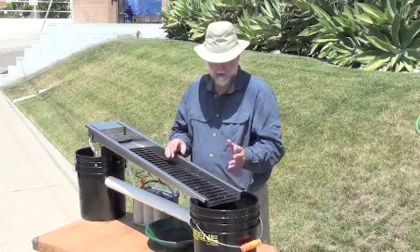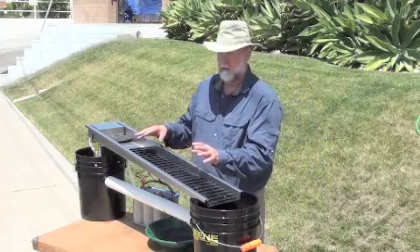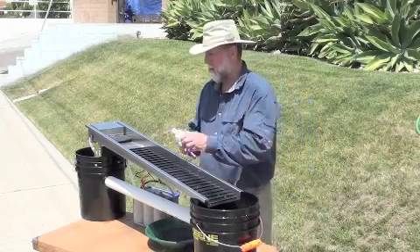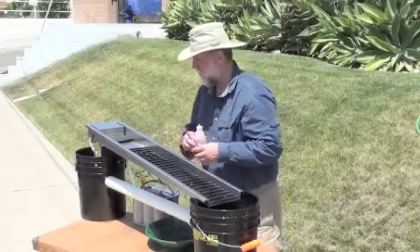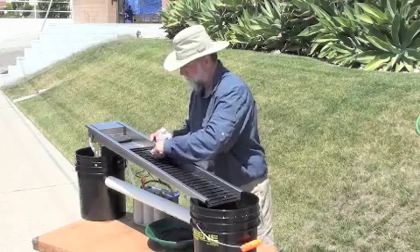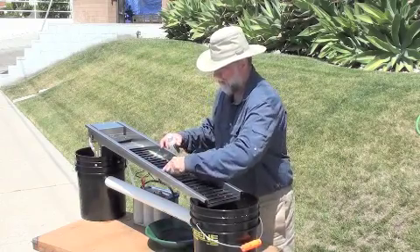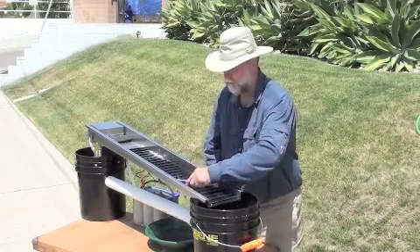Now I think I'm ready to go ahead and get it set up. The first thing I do is run a little bit of water on it, back to the toothbrush, a little bit of whatever your wetting agent is, and splash some water up on it. The toothbrush is used just to rub over the mat before you fire it up — that keeps the air bubbles from sticking. And any place there's an air bubble left on the mat, no gold will stick.